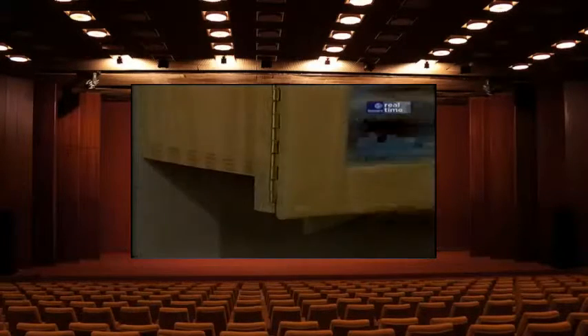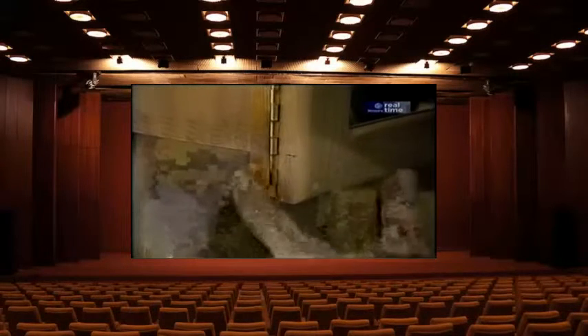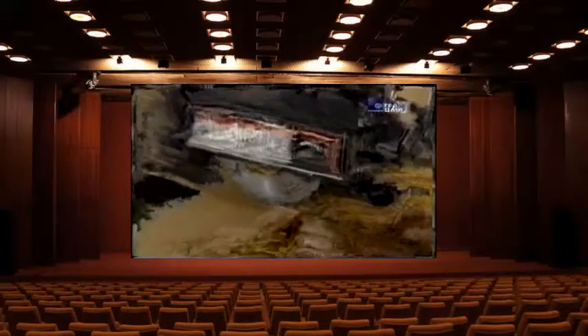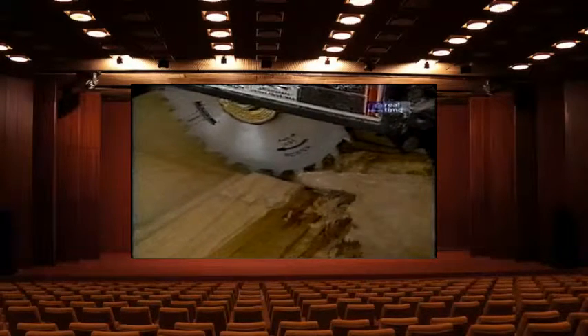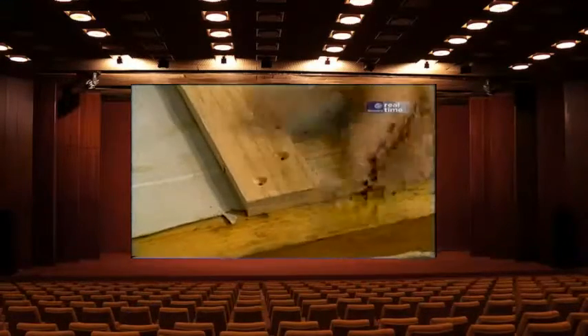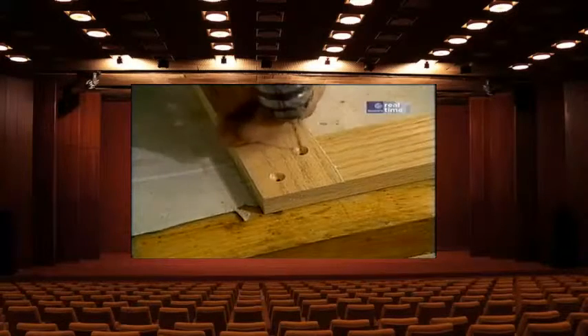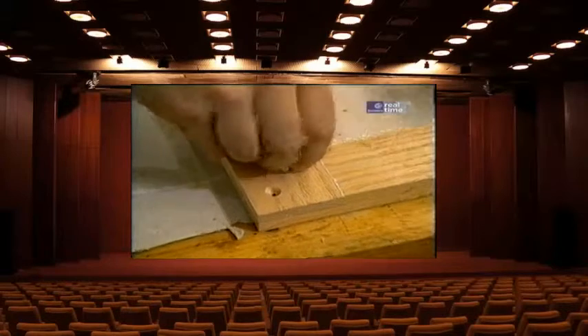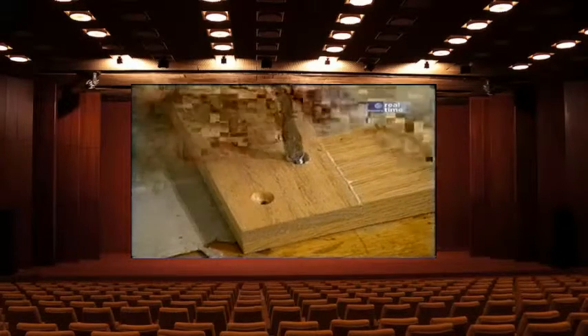The face frame is what the door hangs on. The joints are made using half-lap joints — if you look at the outside of the cabinet, you can see it sticks through half the thickness of the material. I'll make that joint using the dado head cutter on the table saw, adjusting the height to remove just half the thickness of the material, with guidelines for where to make the cuts. Then a little yellow glue on the half-lap joint, set those together, drill some little pilot holes, and drive the screws in. These screws won't show because they're on the back side of the face frame — they're only here to hold the joint together while the glue sets up.